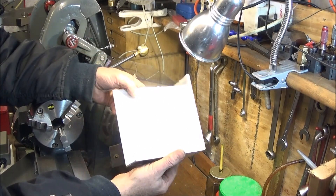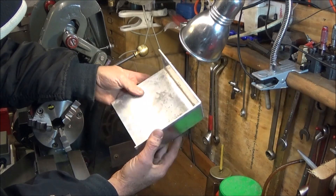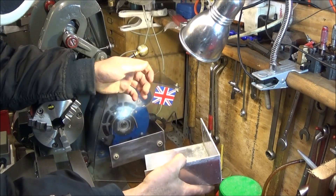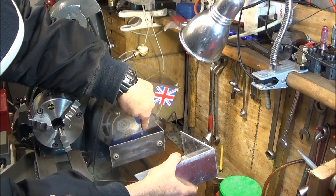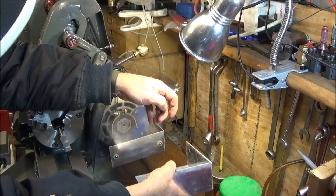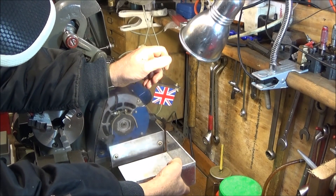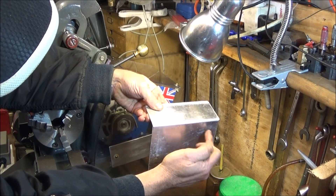Next I've got a piece of aluminium plate, about four millimetres thick, from my spare parts box. You don't need anything as complicated as this — all you need is a piece of plate with a right angle at one end. I drilled a hole in it and put an extra-long bolt that holds the motor to the platform at the back, going through this hole and onto the underside of the motor platform. The nut and washer goes on the underside and tightens it into position. You only need it held on one bolt.